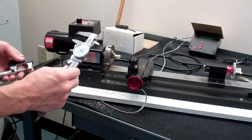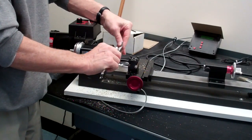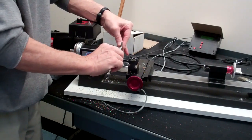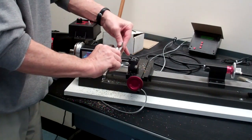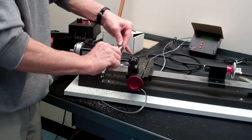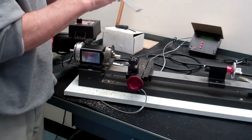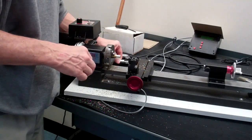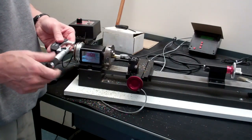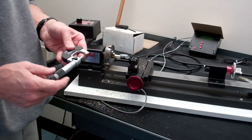You can use calipers to measure this. You have to be very careful though — make sure your jaws are aligned. You can wiggle the calipers back and forth, and whatever the lowest reading is, that's your reading. This is telling me now it's .438, which is about what I would expect. But for lathe work, what you really need to be using is a micrometer. I believe you're going to get some instruction on that in class.